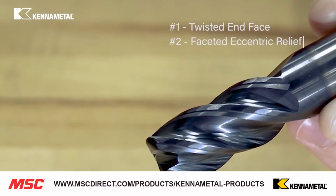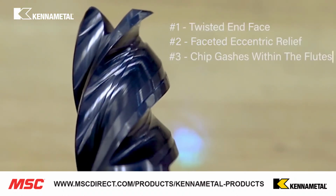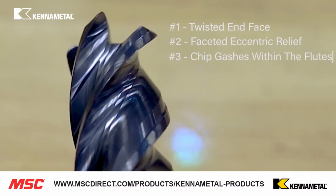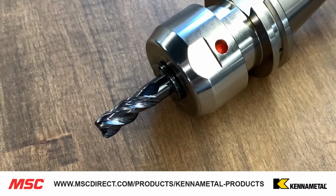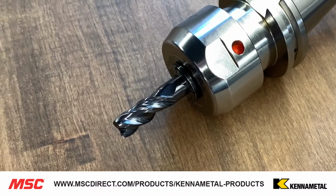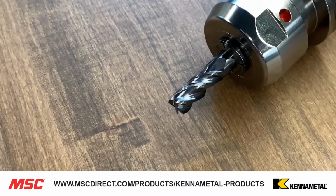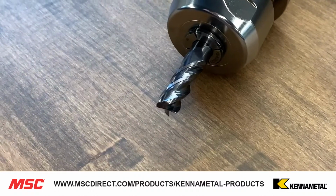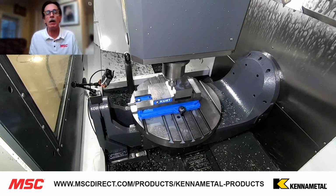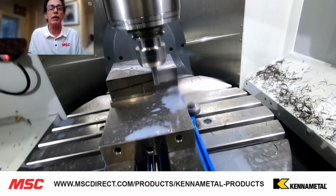You're looking at the faceted relief here. Aaron showed you the twisted end face. We have this chip gashing in the flutes that keeps this tool cool and allows coolant to flow for chips. And it has some non-linear gashing in the end face that makes this thing capable of ramping at 45 degrees and plunging like a drill, which is something you need to keep in mind when you think about creating pockets or eliminating another operation with a different tool.